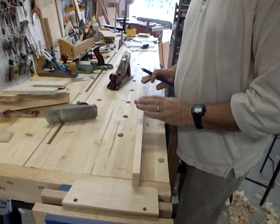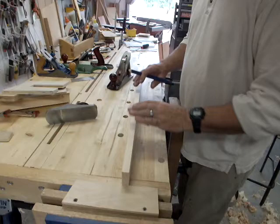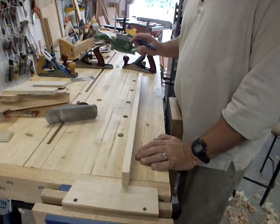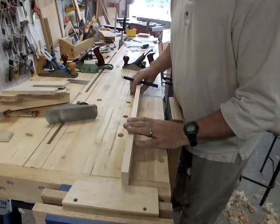When it's in the surface of the wood and you have some width to work with, and on the edge you have opposing grain, sometimes what you can do is plane up to the problem area from both directions and then just finish that area. That's what I do — that's why standard planes always work for me. The little bit of cleanup I need I do with a cabinet scraper or a card scraper; either one may solve your problem.